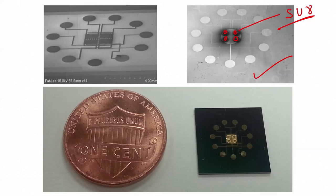Now, a polymer can be conductive — for example, we have used PEDOT:PSS, which is a conductive polymer. But SU8 is a non-conductive polymer or insulator. However, I want these pillars to be part of the gold pad, so when I apply a voltage, the current should flow from the pillars through the tissue placed on them to another electrode — we will see how that happens.